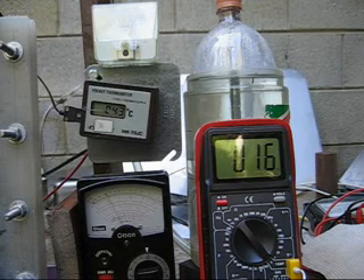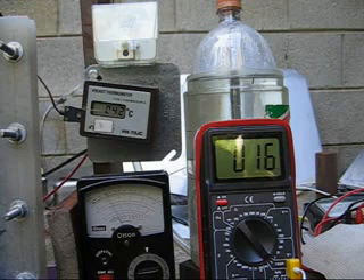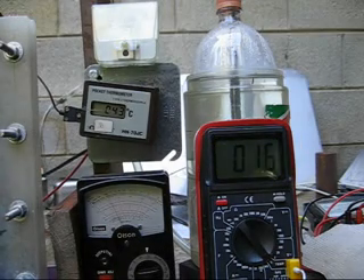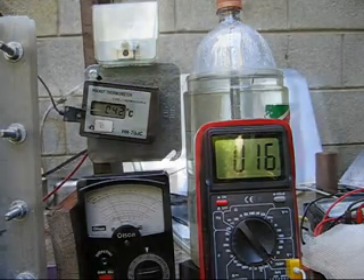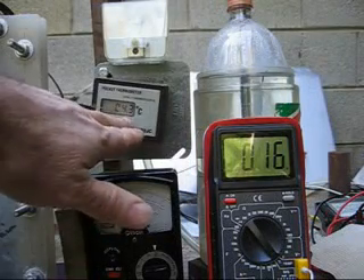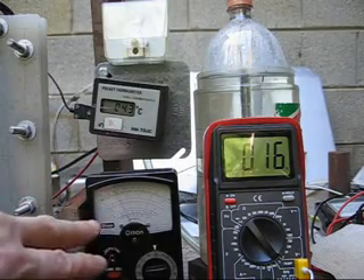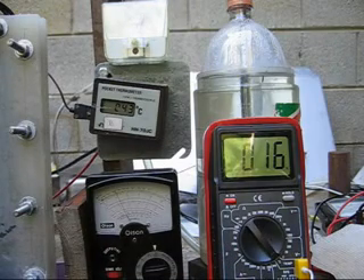The temperature is still climbing after I added that last electrolyte, but now it's going back down again. I heated it up to about 71 degrees C, poured it in, and it started circulating. It gradually heats up to a certain point and then starts to cool back off because it's not maintaining its own heat. We're at 11.75 amps, 43 degrees C — I don't think it's going to get any hotter. 13 volts on the nose, double-checked. Ambient air temperature is 16 degrees C.